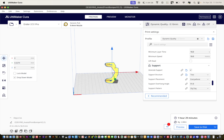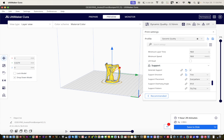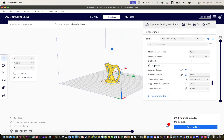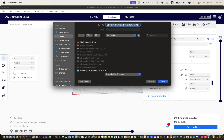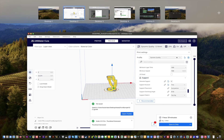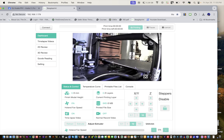One hour and 29 minutes is about how long it'll take. Preview it — you can see the little tree support structure. Spin it around to see how it's going to print, since you might have a different bed. I have the Ender 3 S1 Pro. It should print just like this. Save it to disk, leave the name, remove the 'CE3S' prefix, and save. Then upload it to the printer and let's see how it actually prints!